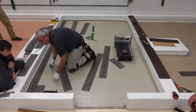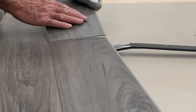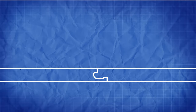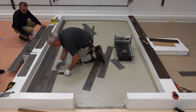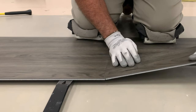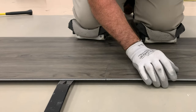Start the second row with the leftover piece from the first row to create a staggered layout. Angle the plank with the long edge of the tongue into the groove of the first row, leaving the plank at a slight angle, then install the next plank. Here is the angle locking from another angle. Continue installing the rest of the second and third row in this manner, with the planks at an angle and gauging the end joint first, then the long joint.